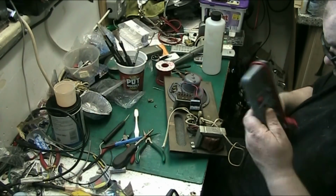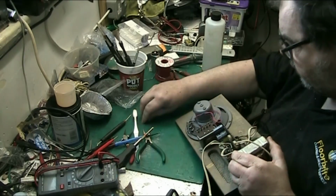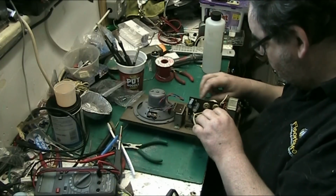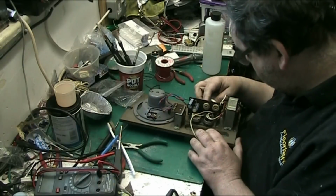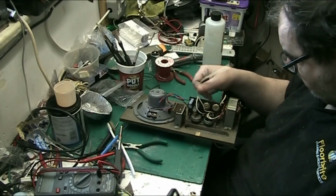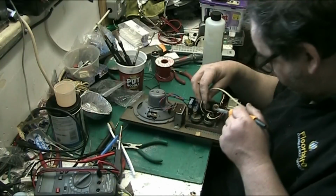And we've got these here, and we want to make sure that we do get the power cord on the right way around. So what I'm actually going to do, right, so there's your power cord, there's your motor on that tag block, there's your power cord. So what I need to do is buzz that out to make sure I connect them the right way.